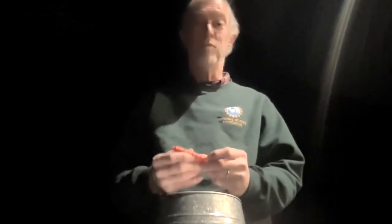The accuracy for radio astronomy is basically a 20th of a wavelength. A wavelength is about eight inches — that span in my hand. So a quarter of an inch is not too much of an error for putting together a radio telescope for 21 centimeters, which is the wavelength of the signal.